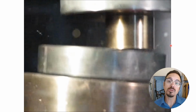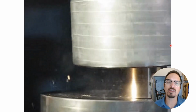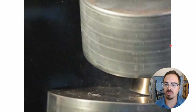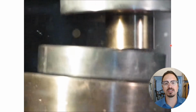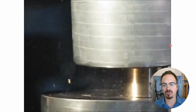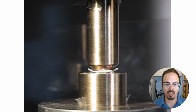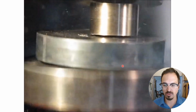When we were using this die with our metal to make jewelry, we only needed about 25 tons of force to get a really, really good, highly detailed example. This broke under 100 tons of force. And the tip of this die is actually quite small, so the actual pressure at the tip of this die, where it was contacting the other die, right in here, would have reached about 400 tons of force in order to break this.